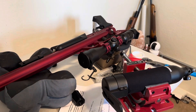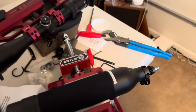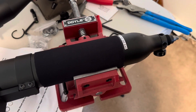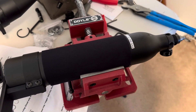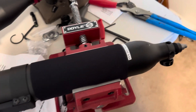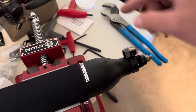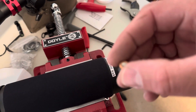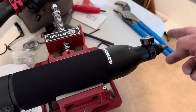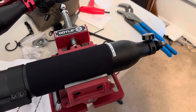Part of the reason why I'm making these videos is I feel like half the time you watch these and people take these apart like they're a piece of cake. Getting that off of this was way more challenging than I thought. I had to lock it in a vice, being careful not to crush it at all — just enough pressure to get it apart without over-pressuring it — and finally was able to get it, but it was not easy. I had to take the fill port out, and there was this other little part that has a little expansion pressure disc thing in there. I've heard of that, I just didn't know what it was. So this part was definitely not as easy as some of the other videos have made it look, so get yourself a vice.